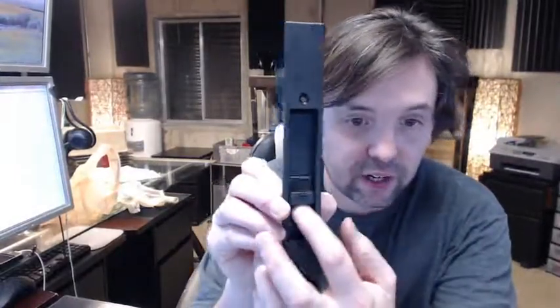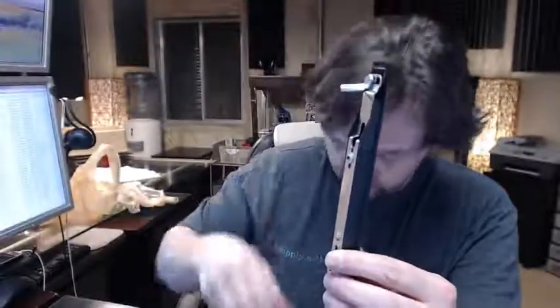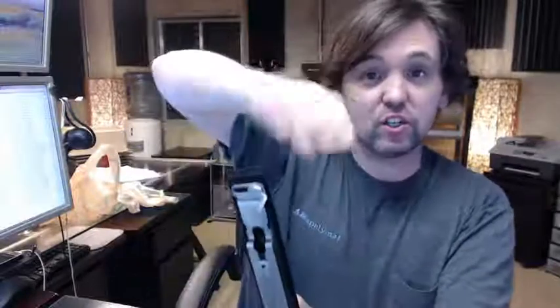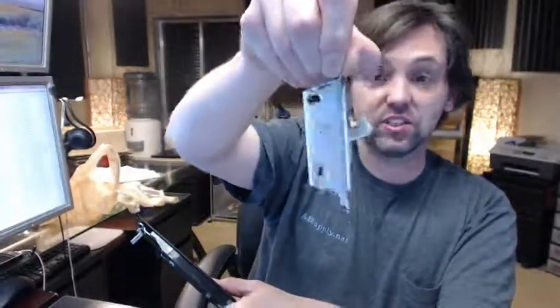The inside trim is going to have your slide handle, and that connects to this tailpiece. This tailpiece is what's going to communicate to the preparation in the edge of the lock body through the locking hub. As you push this handle up and down, because this tailpiece is fixed inside of the lock body, it's forced to make that small little turn that retracts and extends the hook bolt.